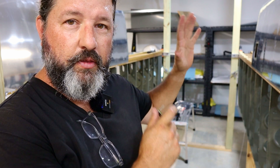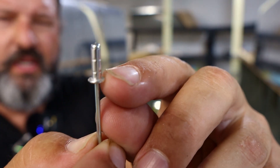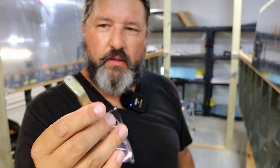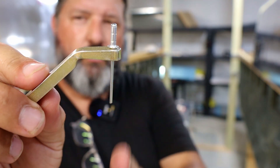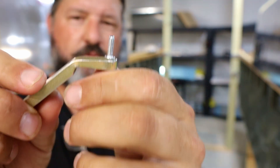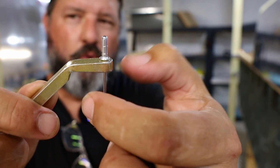Quick amateur tip on the way out — the GoPros overheated with three rivets to go, so I'm done. They're all fastened on. LP4 pull rivets have some little marks on them. To make sure you have the right length of rivet, you just have to make sure that the top mark is exposed once it's inserted in the hole. If the bottom mark is exposed, the rivet is too long — you're just trying to hit in between those two spots. With the wedge tool, you can see it's got a funky angle so that when the mandrel is straight the gun can come in at an angle. You don't have to bend the mandrel much — just enough to get the collet of the rivet puller over it. Then hold the tool flush and inside the tool it will be pulling straight, so it still sets properly.